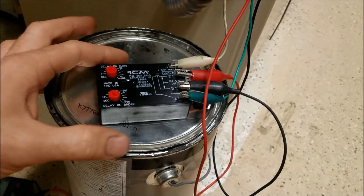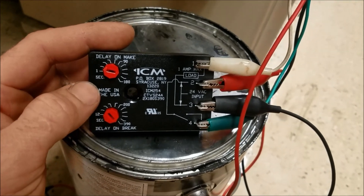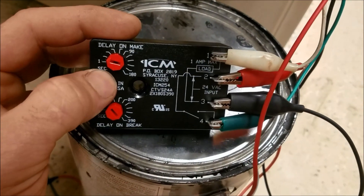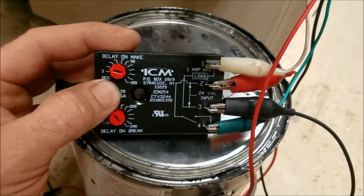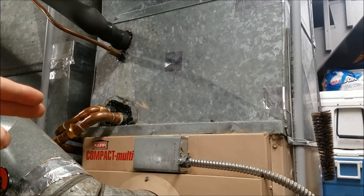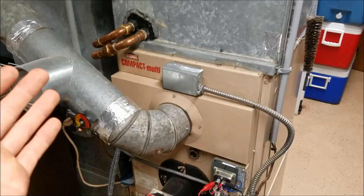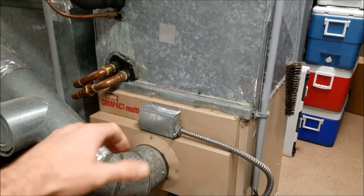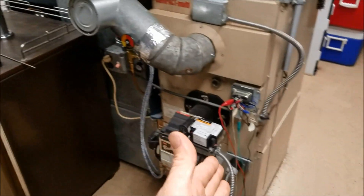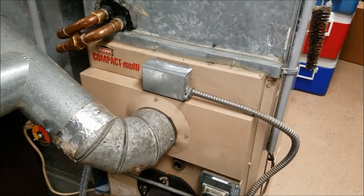I have this test-wired up here to make sure it worked before permanently installing it. Basically, when the AC is triggered on, the compressor turns on outside as normal, but now you can adjust the number of seconds before the fan comes on. I have mine set for nine seconds — that gives the evaporator nine seconds to cool down. Why turn the fan on if it's still room temperature? It also lightens the surge electricity load on your main panel, since the compressor and fan aren't turning on at the exact same time — useful if you're running the AC on generator power, for example.